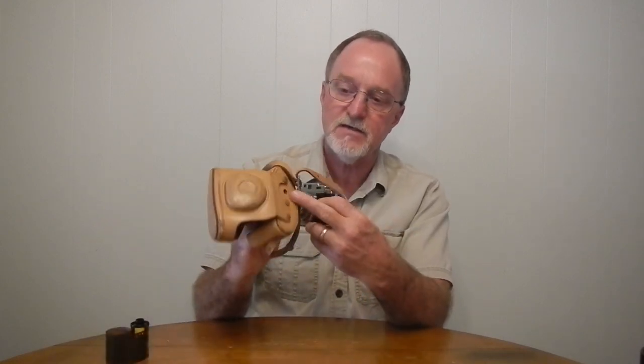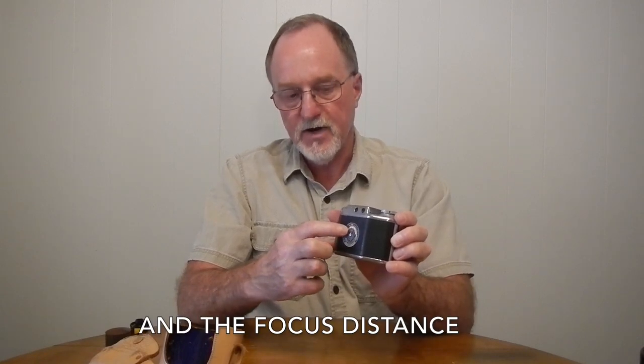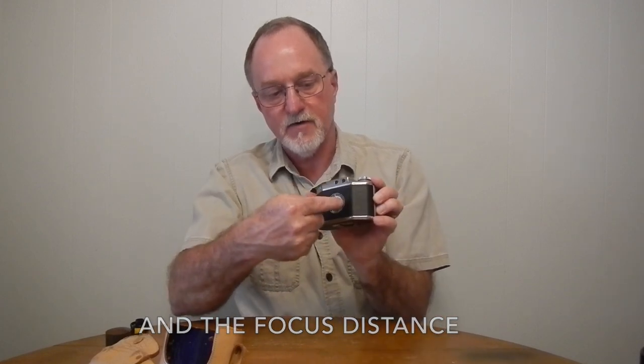It has a helicoid focus, which has a solid tube that's threaded and moves in and out, so it's actually a more robust design in that respect than the Cygnet 35 that I repaired. It has a cool depth of field calculator on the back — you dial in your f-stop and it's got these curved lines showing your near and far distances, the same kind of marking found on later SLR lenses.